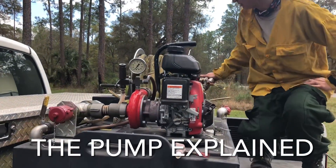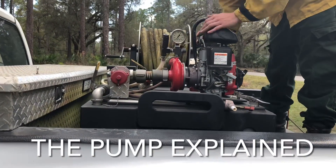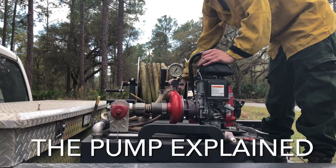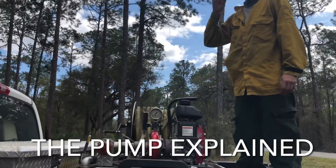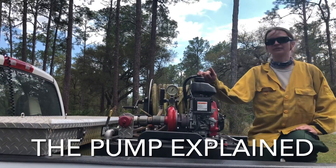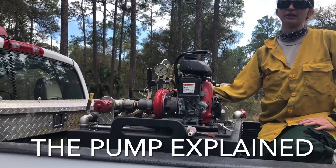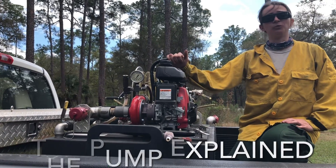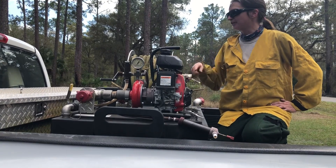It's a good one — not a lot of pressure, not a lot of mojo — but you still want to treat it nice. For all centrifugal pumps, if we follow the plumbing, water comes in the center and comes out this way. This will be important for the priming sequence, because this thing likes to lose its prime. When I say prime, I mean water is all the way through the pump head with that whole impeller saturated with water. That's important because if you run this impeller dry, you will ruin the impeller.